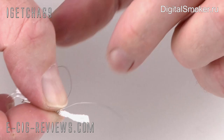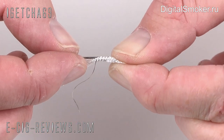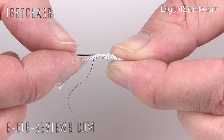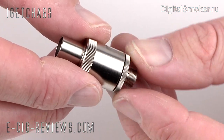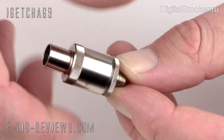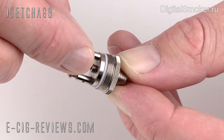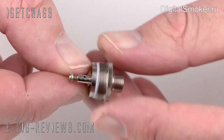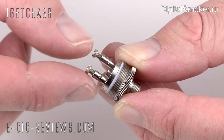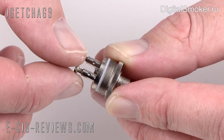That should be about right — you can see there should be five coils. Now the next stage is quite obvious. You need to get the actual Patriot UFS ready. Just unscrew the two sections and make sure the two little screws are already unscrewed a little bit, because you're going to be posting the wire from the heating coil through each one of those little tiny holes. Once the wire is through, just get the screwdriver and tighten them up.